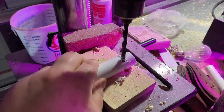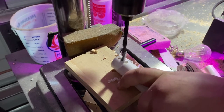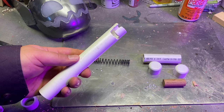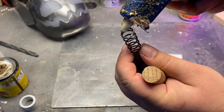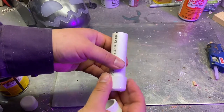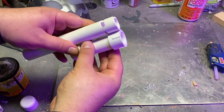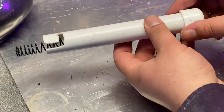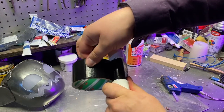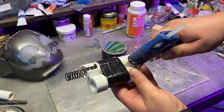Next, I'm drilling a bunch of holes to make an L-shaped cut into the pipe. This is going to act as a catch for the projectile once it's loaded — the screw will slide down and then you push it over to hold it in place. This is being done on the seven-inch piece of three-quarter inch pipe. Then after a generous amount of sanding, we have our little L-catch for the launcher. I take a little bit of hot glue and attach the airsoft spring to the two-inch piece of oak dowel — this is going to act as the base of the launcher internally. Then I use the three and a half inch piece and one of the end caps to make a little holder for the rope for the bola. I also put a little connector on the other end so it would be flush when attached to the launcher. Then we insert the airsoft spring into the launcher, put the end cap on, and use a screw to hold it all in place — because if you don't secure that down, when the spring is compressed it's going to launch that cap right off the other end. I'll admit I was a little lazy here, but this is a prototype, so I just used a little bit of duct tape to attach the rope holder onto the launcher and then put a little hot glue along the sides to keep it more stable.